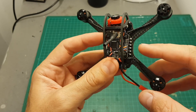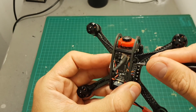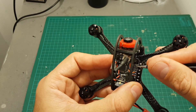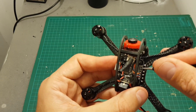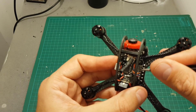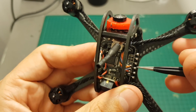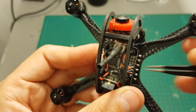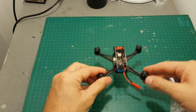If you've got the plug and play model and you're wondering where you should plug your receiver, the answer is here on the right side. These two ports are the ground, over here you have 3.3 volts output if you want to connect a DSMX receiver, this one is 5 volts, and over here we have the two RC inputs. I'm going to use the one intended for SBUS or PPM, so I'm going to connect this receiver and then weigh this quadcopter.